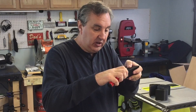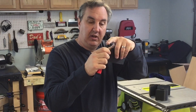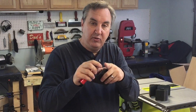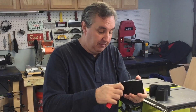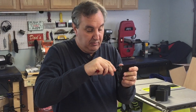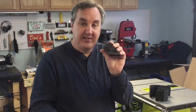The hole on the bottom is blocked because of the raft and there's lip all the way around it. I just take the finishing tool and drag it along — it cuts and carves it right off. You go all the way around; the end of the tool pivots so you can go right around curved edges and cut them off. It's not so sharp that it cuts your fingers, so you can actually cut toward yourself — which you wouldn't want to do with an X-Acto knife. I find this tool indispensable in my 3D print shop. For the hole, I push the tool in and pivot it round and round, and it cuts the hole right out and gives a nice round edge.